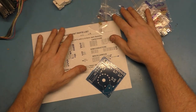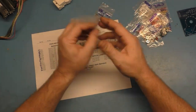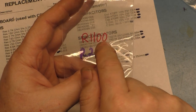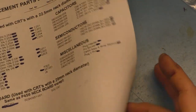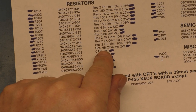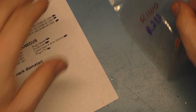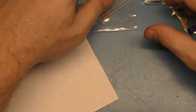So the listing here, I'll put down in the description of the video the parts that are called out for all these. So for instance, R1100 is the part listing on Peter's website, Arcade Parts and Repair, and that corresponds to R213, which is a 0.68 ohm resistor, 5% 2 watts. So that's what this is. I'm going to put a list of all these parts in the description. Everything that you're going to see me install on this neck board, I'll put a list down below. And you should be able to do this for yourself.